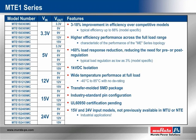The MTE-1 series has high efficiency performance across the full load range, which is characteristic of the performance of our ME unregulated product ranges. Such reduction in load regulation potentially eliminates the need for pre- or post-regulation in many applications. The MTE-1 series provides functional insulation with 1 kilovolt DC isolation test voltage and full load operation across the industrial temperature range of minus 40 degrees Celsius to plus 85 degrees Celsius. The pinout is industry standard, with UL recognition to 60950 pending.